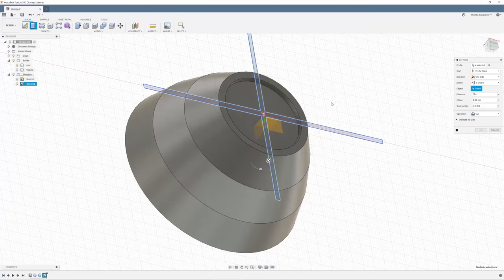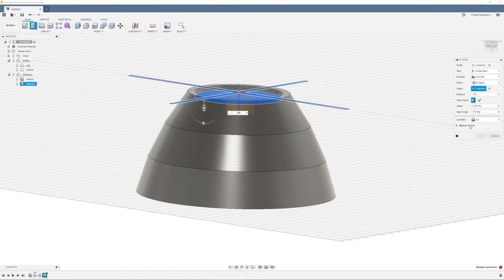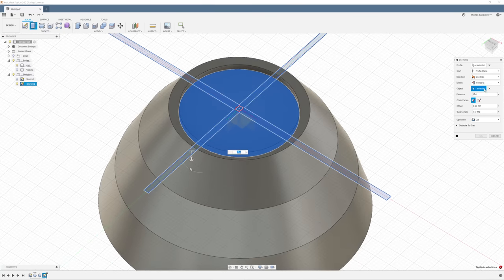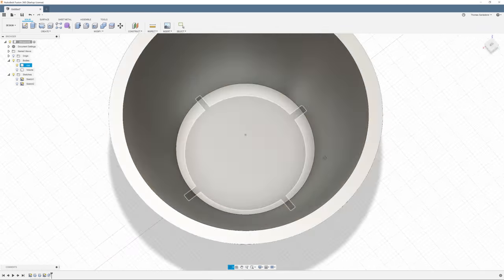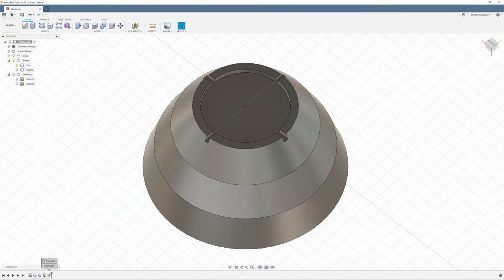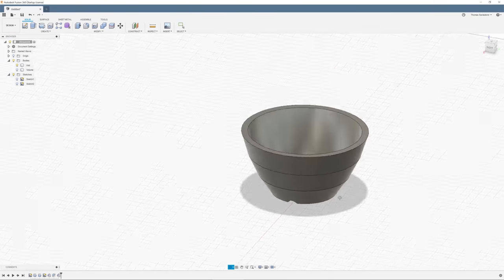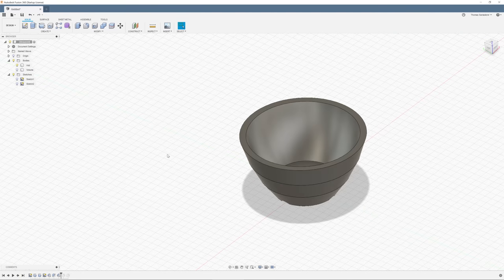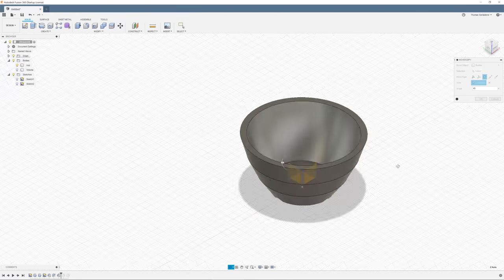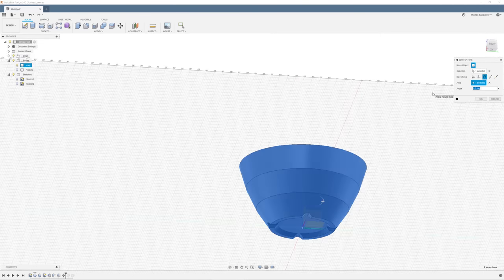I'm not making the dimensions of these parametric or anything — I'm not even adding dimensions, I'm just snapping it to the grid in Fusion 360, just because I'm not going to change these. 2mm is the grid size and that is perfectly fine for this job. Next up, I add a few chamfers on the underside and a few fillets on the top — just one large fillet on the inside of the espresso contact area, again just to make it easier to clean. In preparation of adding a handle to this cup, I wanted to rotate it 45 degrees so that the handle on the side doesn't cover up one of the drain channels on the bottom.